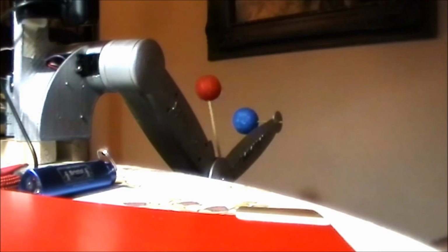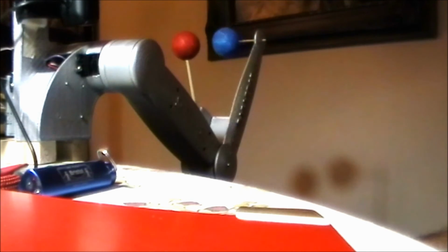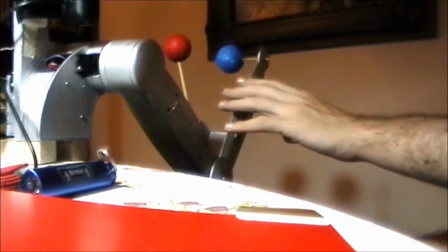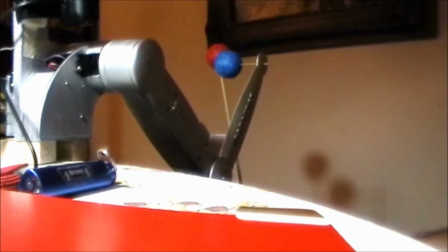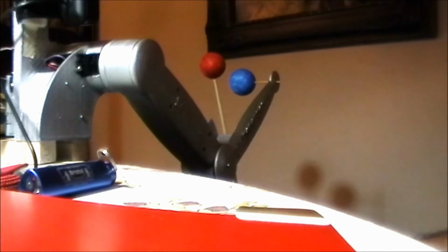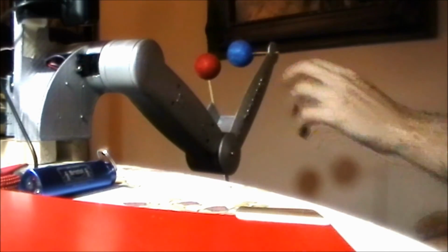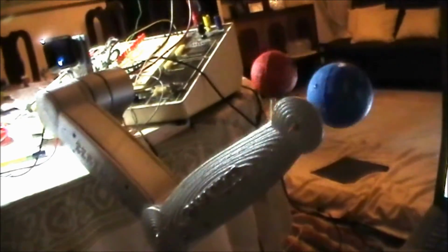Some perturbation tests were made in order to evaluate the system's robustness. In this regard, while the arm performed the control action, it was strongly moved by hand, taking it out from the path that it was executing, but it was observed that it quickly returned to its original position, this due primarily to the fact that the implemented control corrects the position immediately when perceiving the deviation generated, and second, because the servo itself internally has a PID control that keeps it in the position commanded.